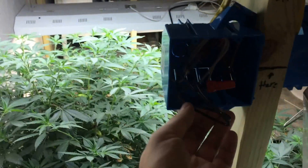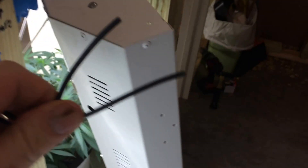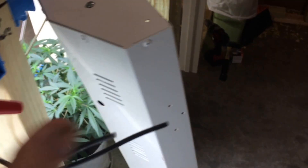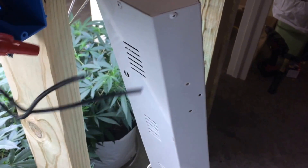I also made this up so that once the sheetrock's on there I can just pull these wires out. There are two black wires — one for each of the hots of each receptacle. I've done that with the grounds also, and with the neutrals.